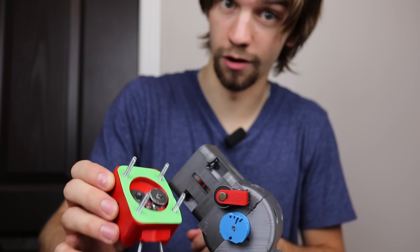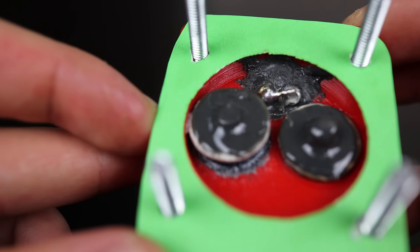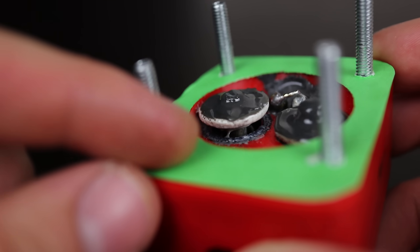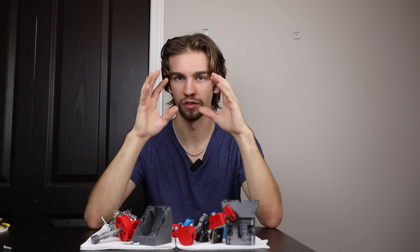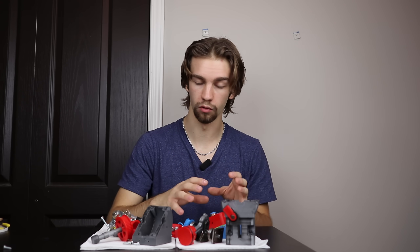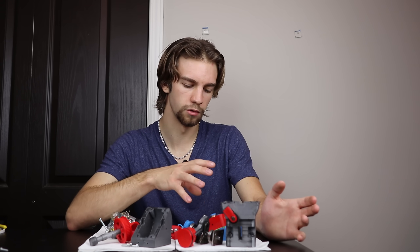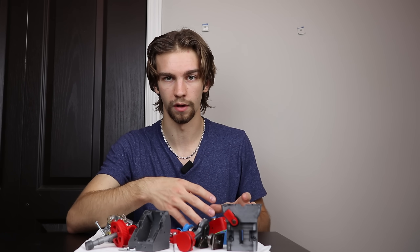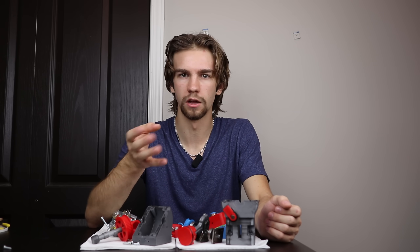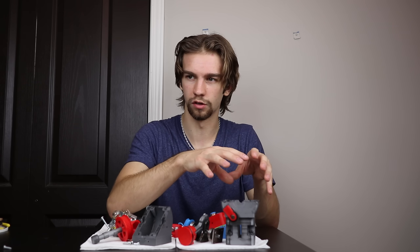This head is pretty gnarly. Having a look at it you can see it's melted the TPU and fused it with all its surroundings, and it's even created these little spiderweb bits on the inside. It's honestly pretty remarkable that the only thing that really suffered any damage was literally the exhaust valve and everything else was perfectly fine. I believe the reason the exhaust valve was the one that suffered damage instead of the intake valve is because it's still combusting as it's exiting the exhaust — this is what causes a burnt valve. This is actually a thing that can happen on any engine: if it's not tuned properly you can risk burning your exhaust valves. That's kind of why when you see flames shooting out of an engine, unless it's tuned to do that, it's usually a big problem.